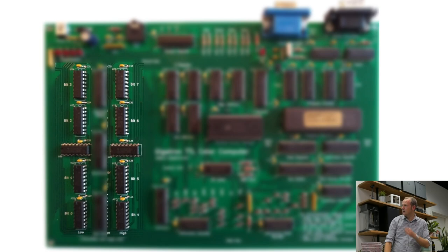We also have a STORE instruction — using it sends the bus to RAM, the only instruction we have to write something to RAM. And we have a BRANCH instruction — a jump — with eight types of jump depending on the accumulator. The ALU: we have one chip per bit, eight chips for eight bits.